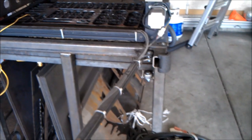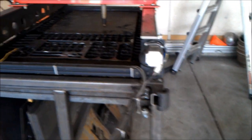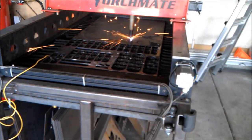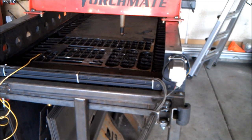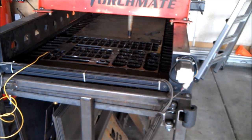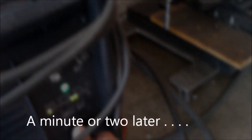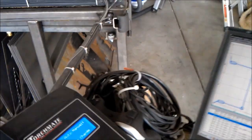I must be running out of air pressure or something. The air looks okay. The electrode's okay. It must be my air supply. I think I was just having an airflow problem — my compressor went off. I got the compressor charged again.